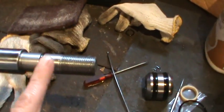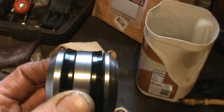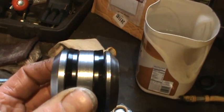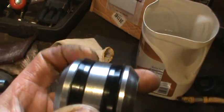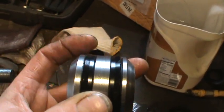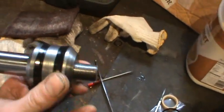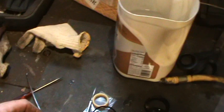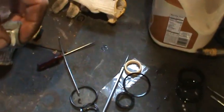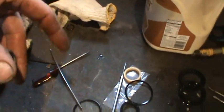On this sleeve there's an o-ring. If you look at it, there's a tapered seal going each direction, facing out — as the pressure goes from one side to the other. If it was only a single-acting cylinder you'd only see one seal, not two. The o-ring is on the inside so it doesn't leak underneath from side to side. It won't leak externally, but it'll just lose power. Then there's a large nut that holds all that together.